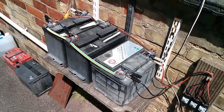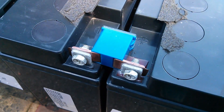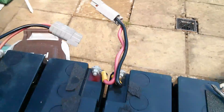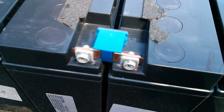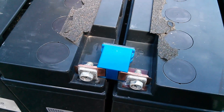So they're going to go and I'm going to replace them with the gel batteries. I've got to remove these fuses — 100 amp fuses — which are between pos/neg on one side and then the connectors on the other. These are actually set up as 24 volt banks. These came out of UPSs, so that's 8mm on there.